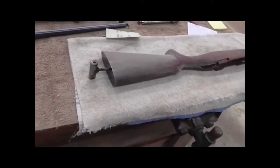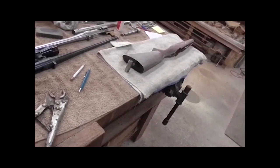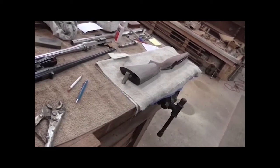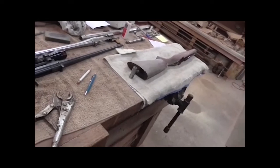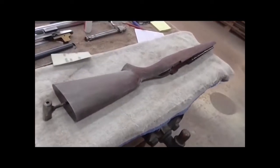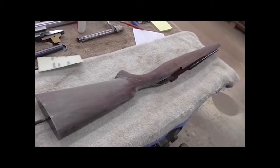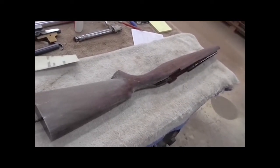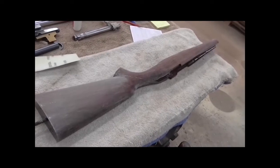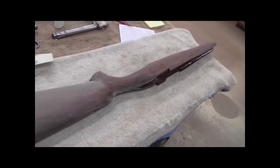Back on the Mauser, I've got probably 15, 17, 18 light coats on it — mostly brushed — and then the last four or five I've sprayed. But you have to spray two coats on the last one without sanding in between. The Permaline instructions say you can do that if you do it within four hours, because if you wait longer, it dries too long and the next coat won't bond chemically. The bond needs to be chemical. By sanding and scuffing it, you get a physical bond, which also works well. But when you spray within four hours, the first coat isn't quite cured enough and the second coat will bond chemically — that's my understanding of it.